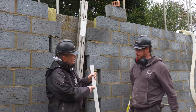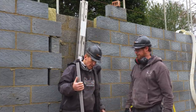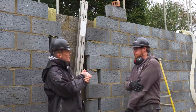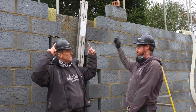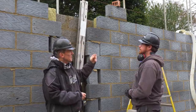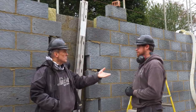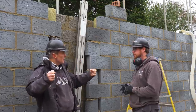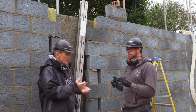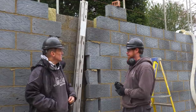Every one of these holes has to be fixed — they've supplied enough screws for every single hole, so I'm going to put one in every hole. Honestly, this whole thing about wind posts and wind loading on walls — this isn't the gable end, it only goes up to gutter line, there's a gable on the front wall. Given how sheltered it is here, it's hard to believe. But if you put steels onto a wall or internal walls, that firms it all up anyway — you can't imagine there'd be any tendency for it to blow around. Anyway, it's on the drawing, you've got to do it.